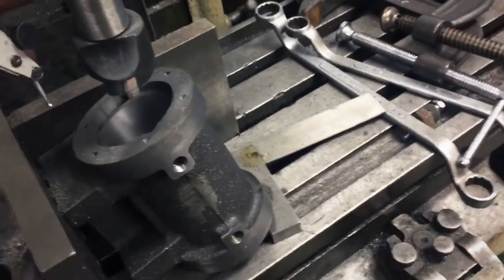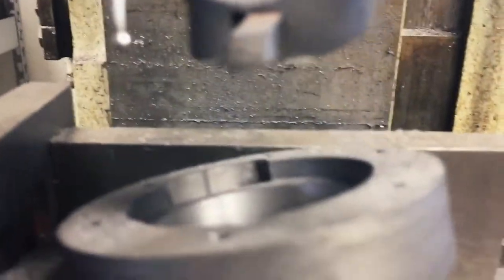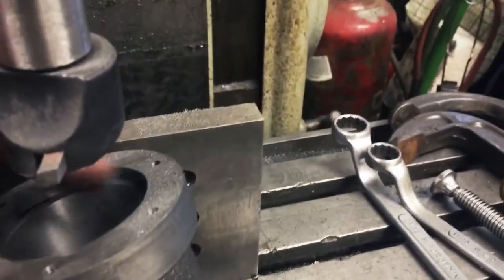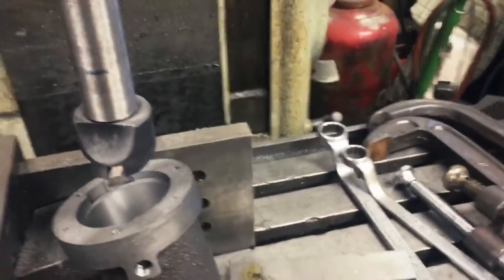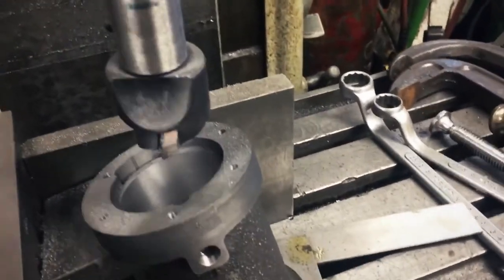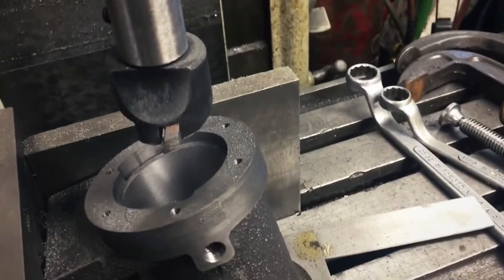I have a hose clamp, put this around there, and I bring the indicator. I'm going to go flat here. But I bring the indicator down to the same level as the tool bit. I swing that around, that edge, this register here on there, until I zero. Lock the table, and now when I plunge, I know I'm getting zero the whole way through the bore, because that doesn't change. The table rises.